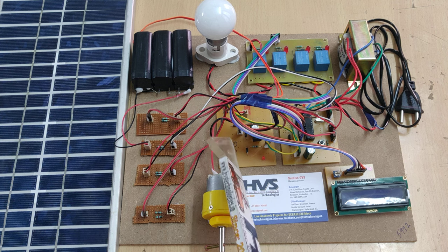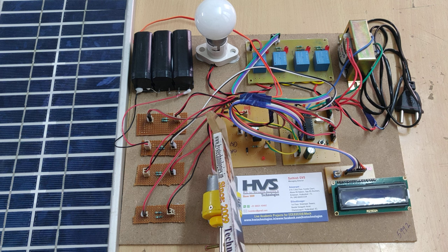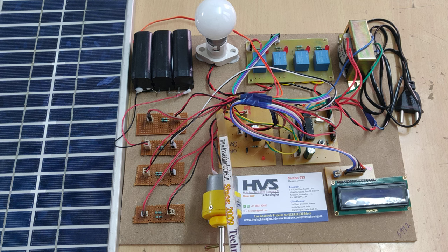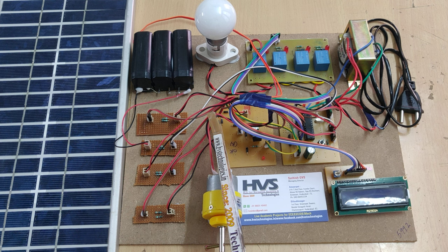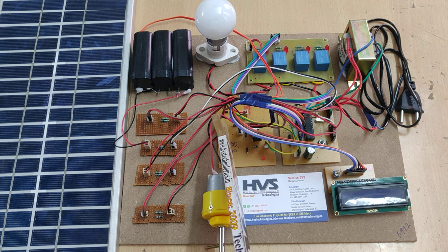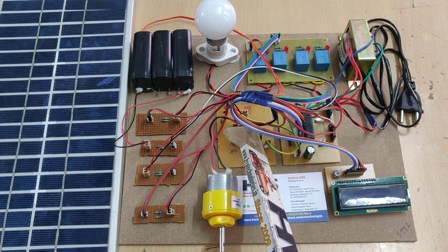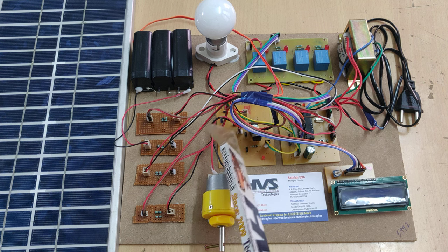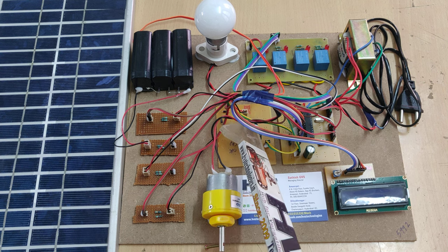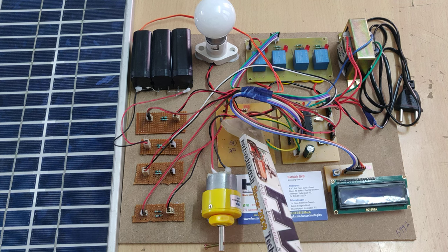This RPS circuit has three stages. The first is rectification — this rectification circuit will convert the voltage from AC to DC. The rectifier circuit is connected in a full bridge rectifier configuration. The rectifier output is given directly to a capacitor, which converts the pulsating DC voltage into filtered DC.